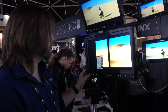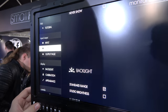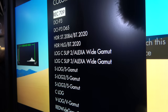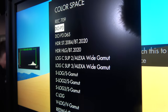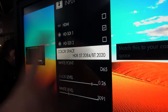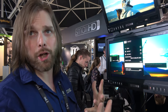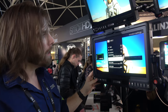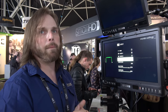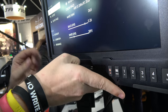Is this ready for HDR? Yes, this actually is ready for HDR. If I go into the menu system and turn on this calibration LUT, then go into the input, I can select a color space. Right now we're in a default Rec. 709 — this footage is already graded — but you have various spaces here for HDR. Rec. 2020 is in here; obviously on an already processed image it looks a little crazy, but you can adjust the individual black level and white level to really customize the HDR preview. You can also load 3D LUTs via an SD card slot in the front of the monitor — this opens right here, there's an SD card slot right there.